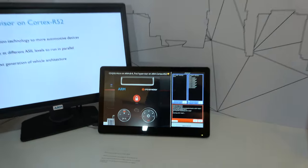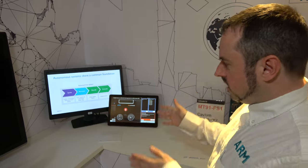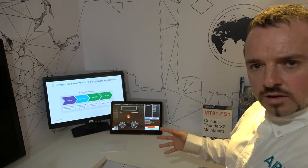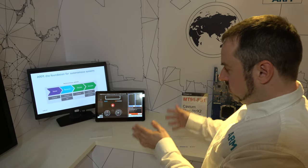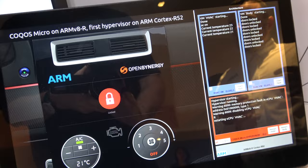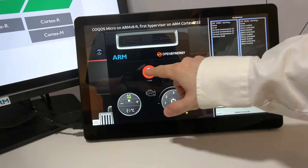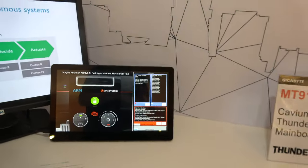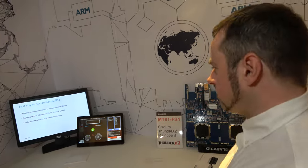Over here is something going on with the ARM Cortex R52. The R52 — the R series is targeted for real-time or safety-critical systems. This is an automotive demo. What we're showing is that the R52 introduces the hypervisor to the R series. Here we're running two separate pieces of software — two virtual processors. One is running the air conditioning system, and one is controlling the door locks. If I introduce a fault into the air conditioning system, you see that stops responding, we get the warning light — but the doors can still open and close. So you have two safety-critical systems, but they're separated, so you can crash one and the other keeps running. And this runs on the new R52 real-time chip.